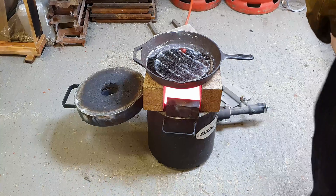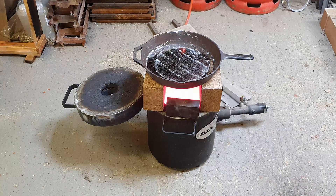Incidentally, you don't have to wear a mask for melting zinc, but you do have to wear a mask if you boil it. Zinc boils at 900 degrees Celsius, so as long as you keep it below that temperature you're absolutely fine. Bear in mind I'm talking about pure zinc, not zinc with things like cadmium in it.